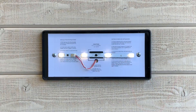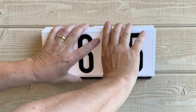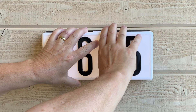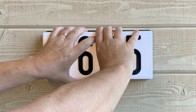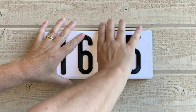After the sign is lit and no shadows are present, replace the lens. To do this, squeeze the middle of the top and bottom and place it into the backplate. The tabs on the lens should snap into the backplate. Alternatively, you may slide the bottom of the lens into the bottom of the backplate and squeeze the top of the lens and snap into place. The lens might fit snug, but be careful not to use excessive force when replacing the lens.